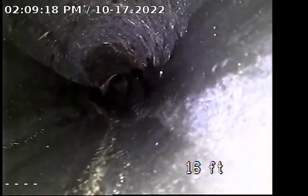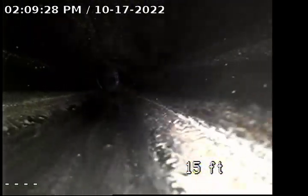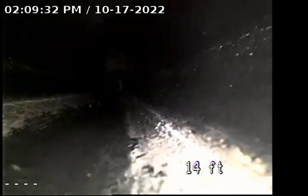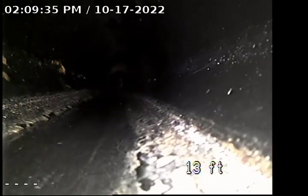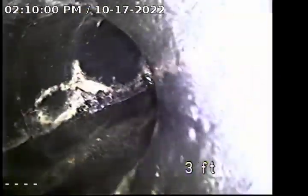The back bathroom seems to be an addition. As soon as it connects to the ABS to cast iron connection — the cast iron is the old original piping, the ABS is all new piping — I got stuck at the ABS to cast iron transition, which is marked with white tape inside the master. The ABS looks good.